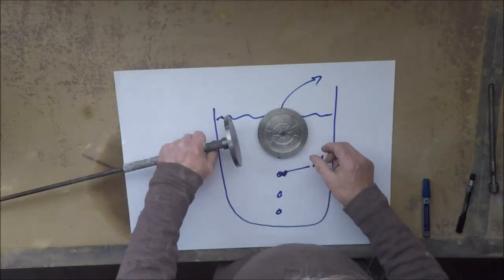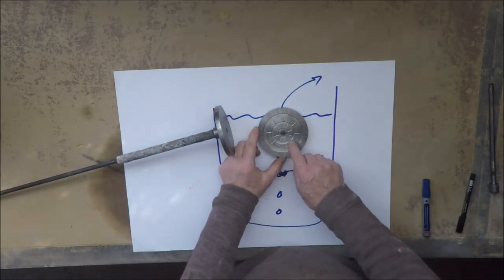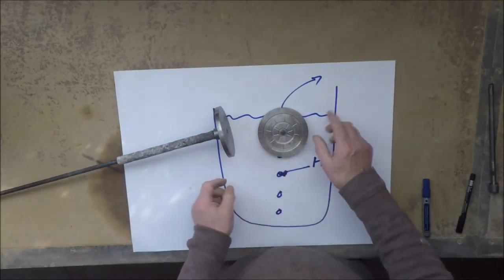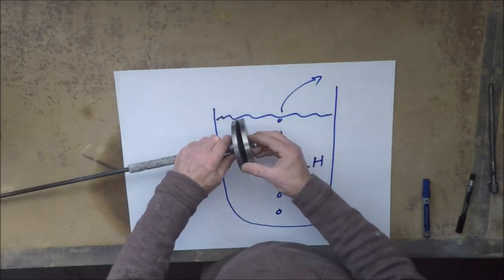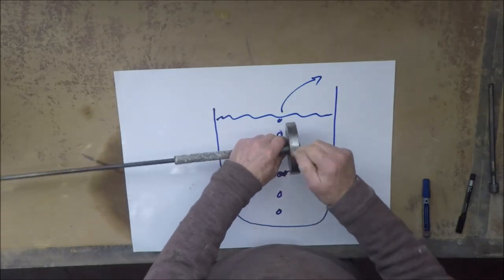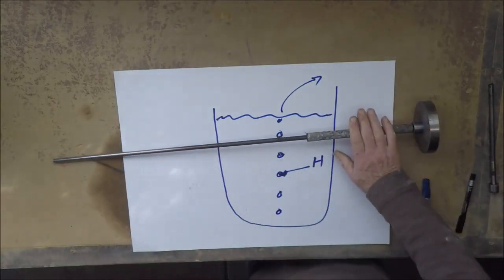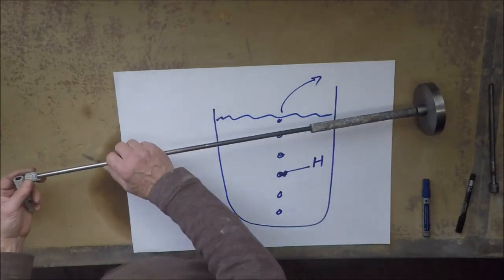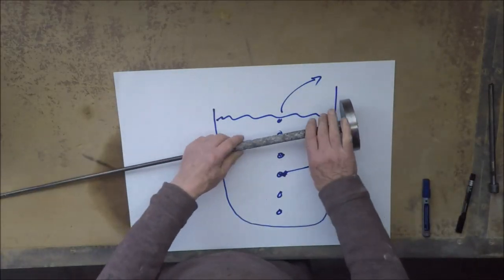Here is the inside of the new lance — this face is just flat and plain. We've got five-thousandths-of-an-inch deep slits — there are actually 32 of them around this one. The rest of the arrangement is just to make certain the gas is fairly evenly distributed out to the groove. The central bolt has a groove so the gas can get from the tube out to there. This part is made out of cast iron; this tube happens to be a piece of 3/8 stainless steel.